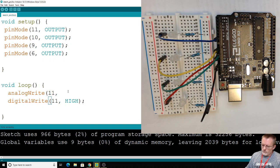And we also have options in between now. We can do 1, 7, 12, 47, and so on. And selecting these other numbers is what's going to allow us to control how bright the LED is. Now for my advanced students, basically what we're doing with the analogWrite is, we're not actually sending analog information. It's still digital, but we're turning the digital signal on and off rapidly.